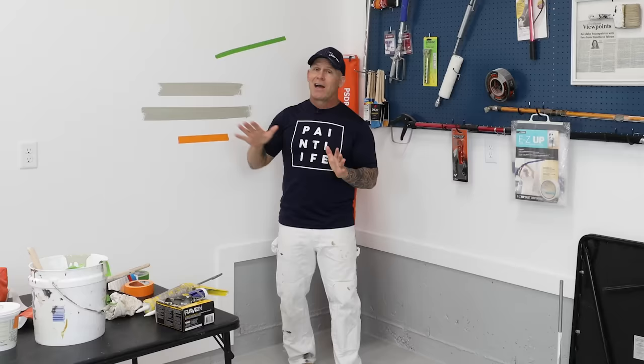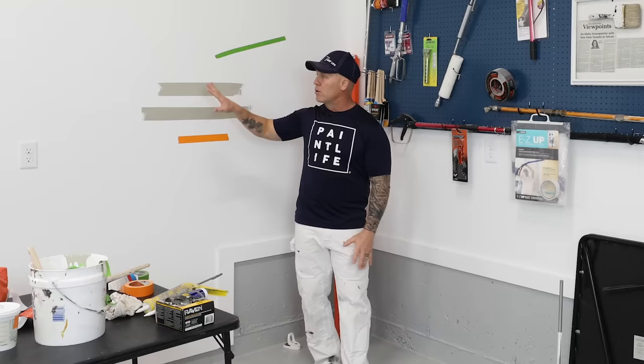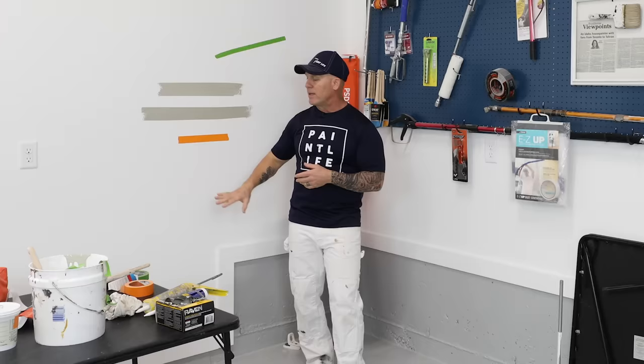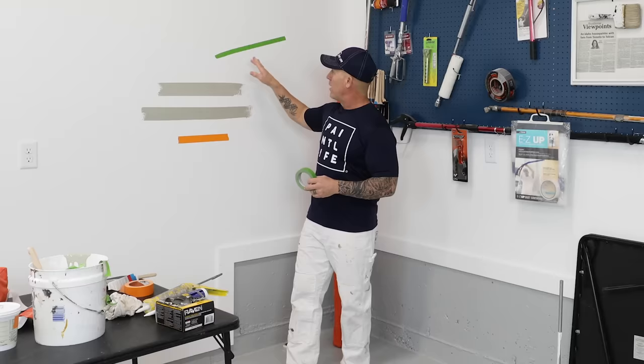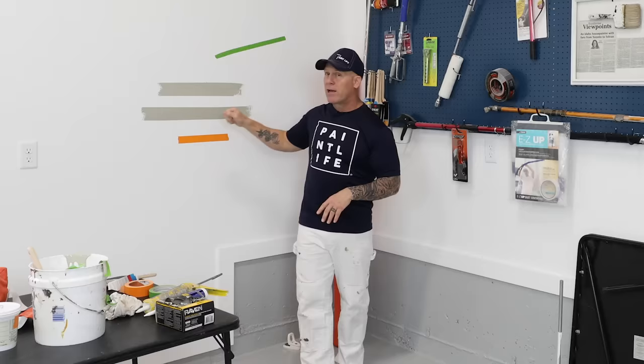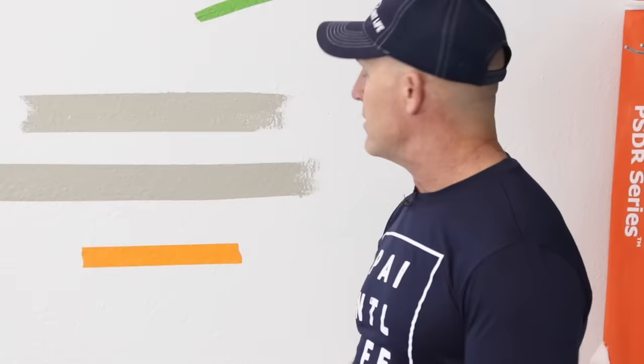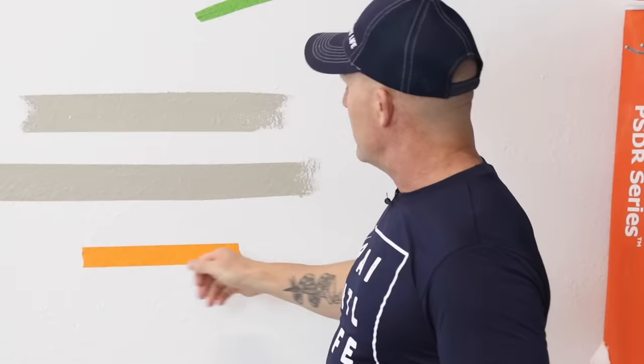In the UK, Europe, and Australia, Level 5 finishes are most common. Where we come from, you typically see orange peel or what we call Sun Valley texture — a smooth texture with some voids, not a true Level 5. On a Sun Valley texture I probably won't need caulking; I'll use Frog Tape. Production tape is for smooth surfaces and spraying. On glass or extremely smooth surfaces, spraying is great because it lays paint on top without forcing it under the tape, unlike brushing which actively pushes paint underneath — especially at an angle.